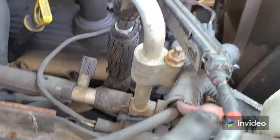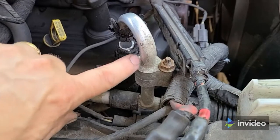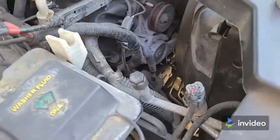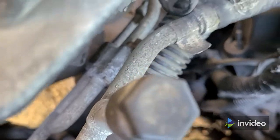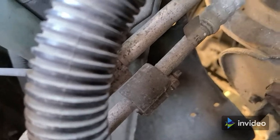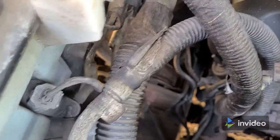You can see this pipe is already cut. This is the fitting for suction. Underneath the suction line you can see there are two fittings for liquid. We're going to go into the top fitting, and you have to make sure you get the right one. I've also cut these pipes off.